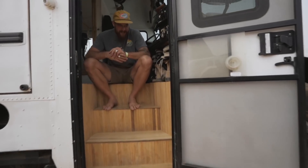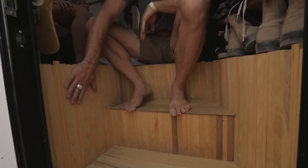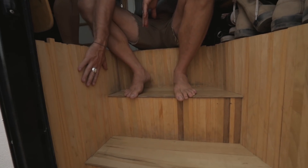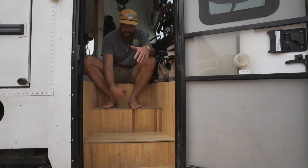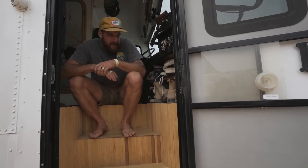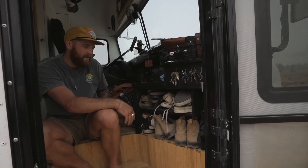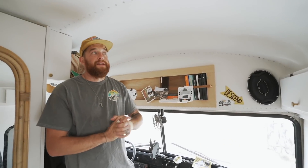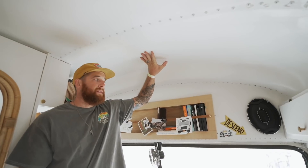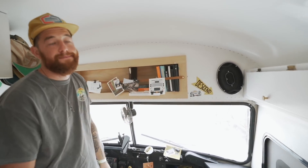These are the stairs — I lined them with strip wood, ripping down oak and birch and basic plywood, glued it all around, and used the same flooring we have inside for the stair treads. Over here we took out the original heater and built a basic shoe rack. Inside, we took down all the original ceiling panels, did spray foam insulation, and then I had the great pleasure of riveting it all back up — as Kaelin says, 'it's very riveting stuff.'